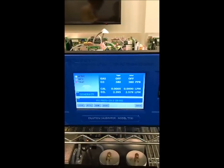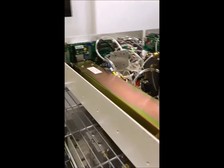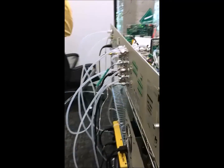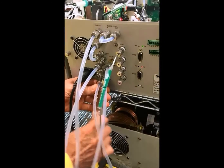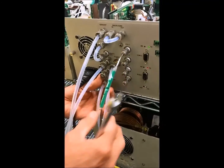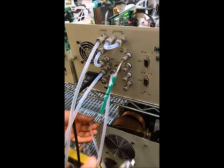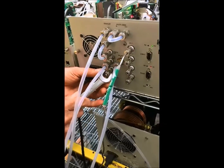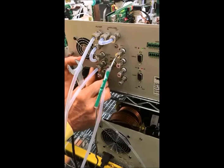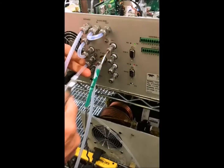One of the things that's crucial is to go to the back and find out just how much pressure is being generated by the tubing you're using. You need to find out how much pressure is inside the calibrator to see if there's some back pressure in there. Then we'll know if there needs to be some work done in the calibrator, or we'll find out how much pressure difference there is and be able to subtract that away. I have four ports in common here.